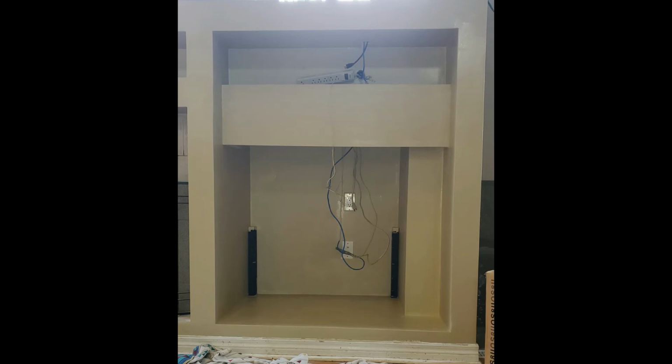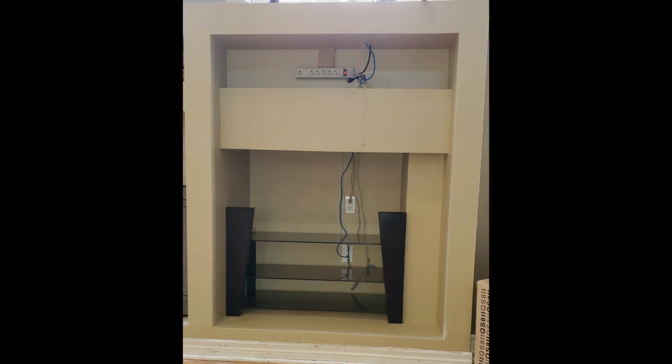So I cut down 4 pieces of 2x4s, which are shown in this picture, and I put the notches, 3 on the right side and exactly on the same height on the left side. Similarly, I have the same configuration for the front portion, so that I can slide in my glass in there. So it has to be big enough so that the glass goes in without any problem. Once the back pieces are installed with the screws, the next step is to finish the TV cabinet.